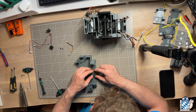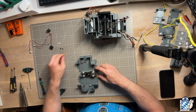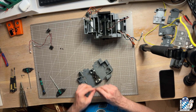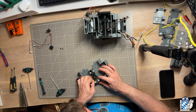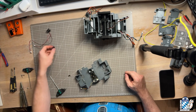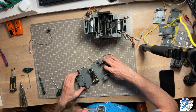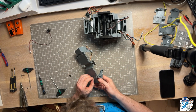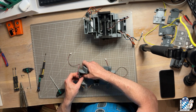Add the IMU and an I2C cable to the power board. The IMU screws down on the standoffs with short M2.5 bolts, which we don't see in this video. Lastly, add the motor fans with self-tapping countersunk bolts from the bottom. The motor fans are really optional, because the vents should be enough for cooling, but they don't cost much or pull a lot of power.